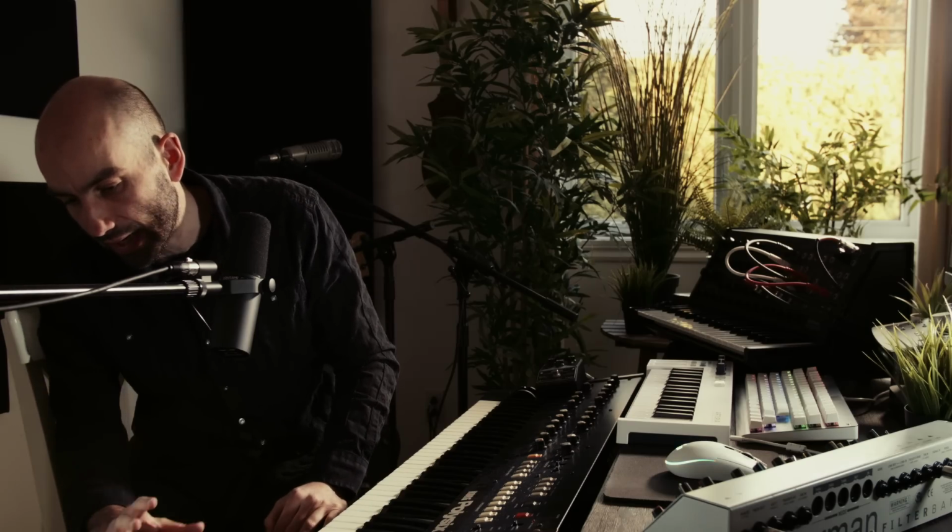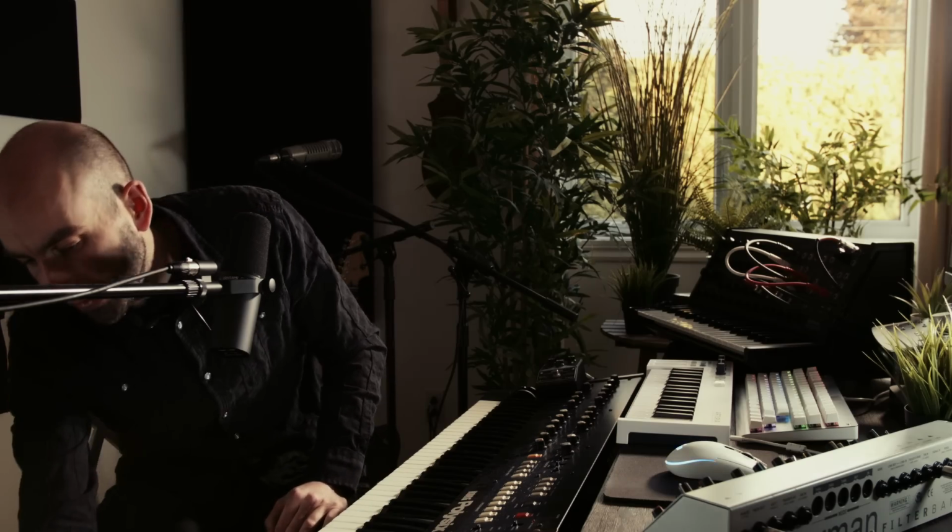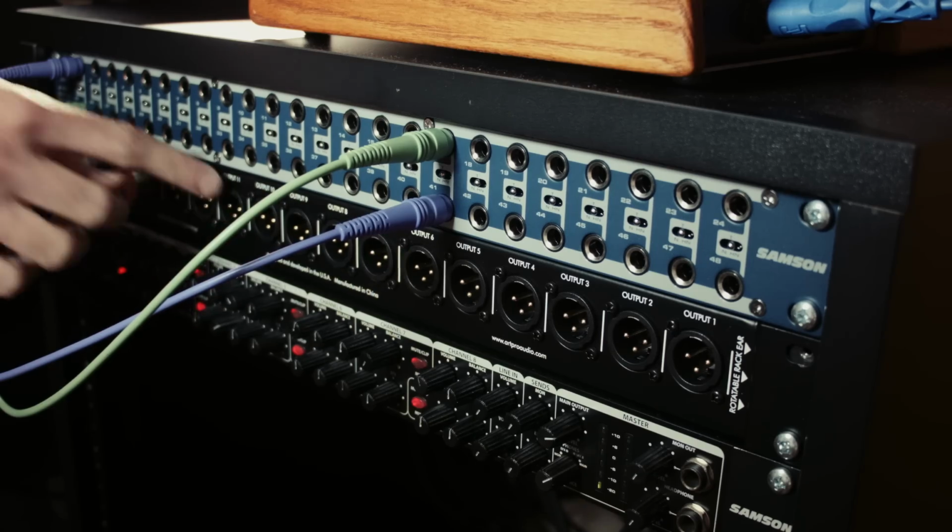It's not going to transport phantom power through an XLR connection. So the way I came around this is that I'm effectively using this XLR patch bay here as kind of my main bus to buffer both the 1/4 inch stuff coming from the 1/4 inch patch bay and my XLR phantom power mics, and kind of group those together.